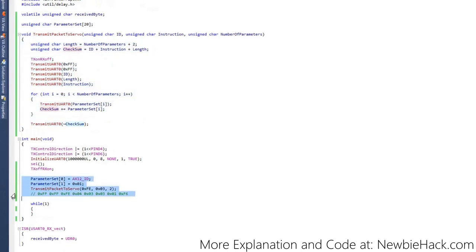In the next video, I will read data from the digital servo to verify that the ID was actually set on the servo. I didn't have the servo connected at this particular time, but in the next video I'll connect the servo and the 9V battery and monitor the line with the logic analyzer to see if we get the correct response back. If you're following along or producing successful projects helped by these tutorials, please let me know via the contact page on newbiehack.com.